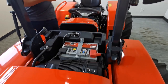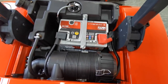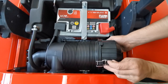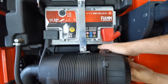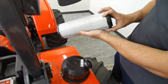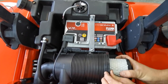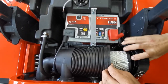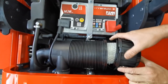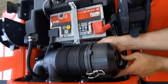Under this cover here is our air filter and battery. Although we've got an alarm system to tell us when the air filter is blocked, it is good practice to check it weekly. Pop it up out of its holder, undo the top and bottom clips, pull it off, and pull it out to inspect it. If necessary, give it a blow from the inside out with compressed air. Reinstall it — you'll feel it go back in. Make sure the top symbol is pointing up, as that makes it easier to get the cover on, then pull the clips back over and pop it back down.